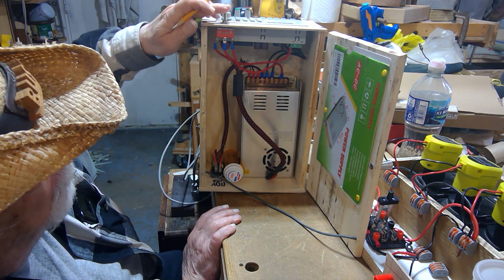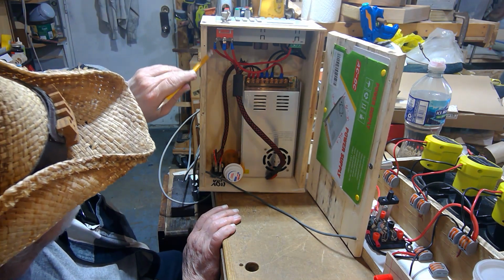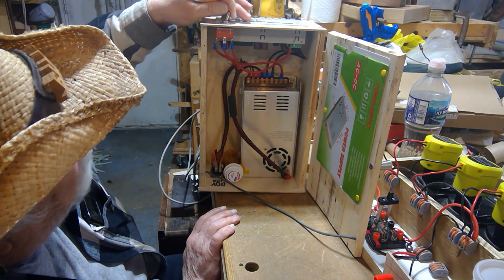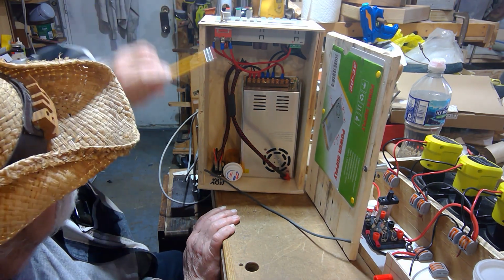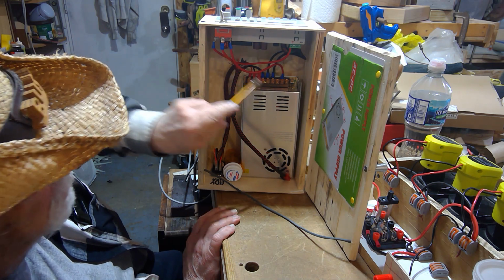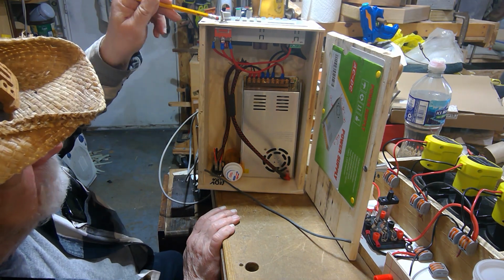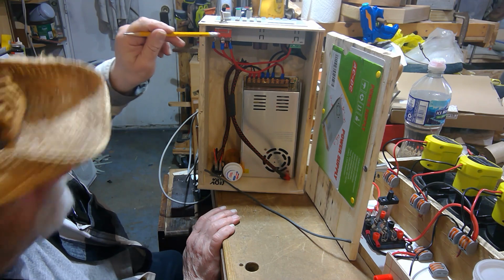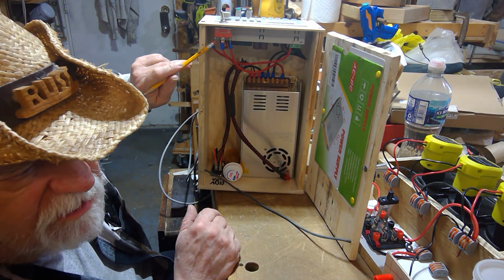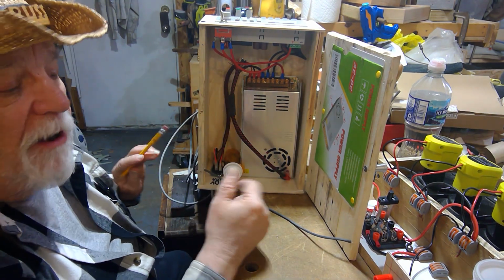And then on this one, when I push the switch over there, that goes to the DC power right here, this terminal. So this terminal is going to my positive on my power plug-in, my power pole. If I go the other way, now it's pointing to this lead. This lead is going to the output of my inverter. So this is 24 volts coming off the inverter. When the inverter is turned on, I'll see 24 volts at this terminal. And then I switch between this terminal and this terminal. They're both DC volts, but the source here is a 24 volt source. And this one is anywhere from 6 to 70 volts if I want to plug a DC unit into here. Now I can go all the way to 70 volts.